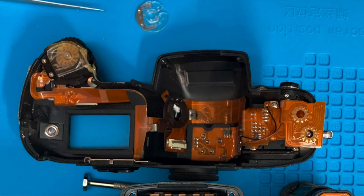Once the knob's down, you can put the plate back in position, screw these back in, and then plug this cable back in. Remember to solder these back in, then place the whole top plate back on the camera and screw these two pieces back in. Put some batteries in, test the flash, test the metering knob, and see if everything works. Before you start screwing everything in, make sure you check the alignment of the top plate with the body — I had an issue where the front of the prism where the Nikon logo is didn't align very well with the front of the body. So make sure everything is aligned well, then put your screws in and put your front plate back in. Don't forget the screws.